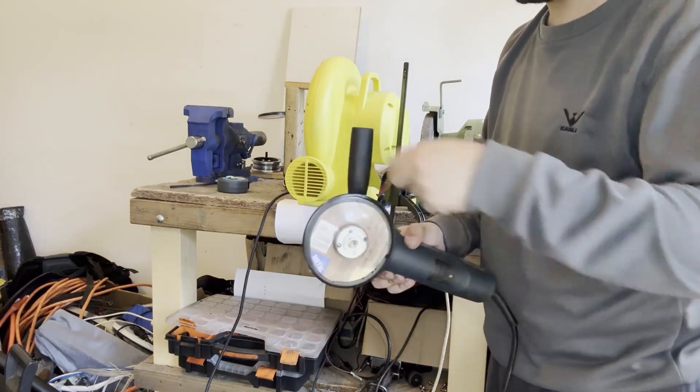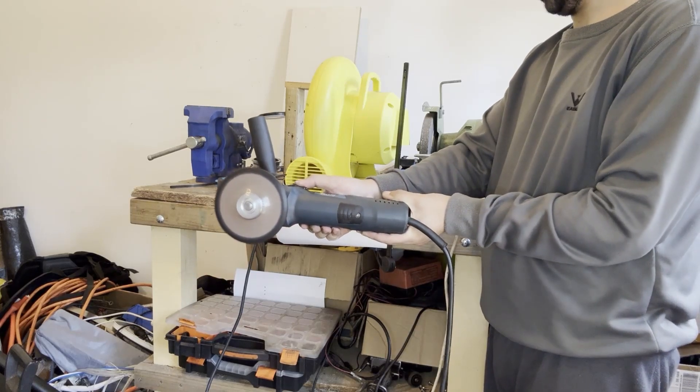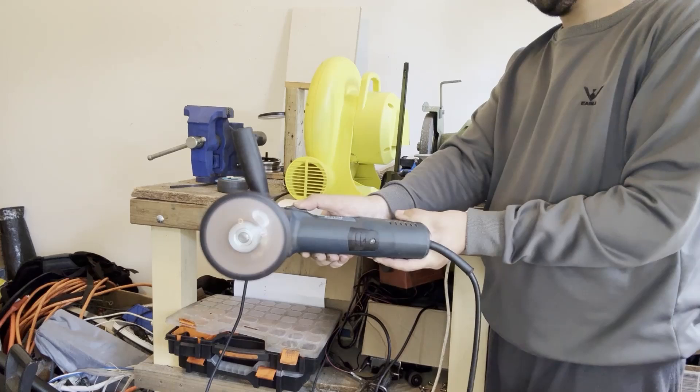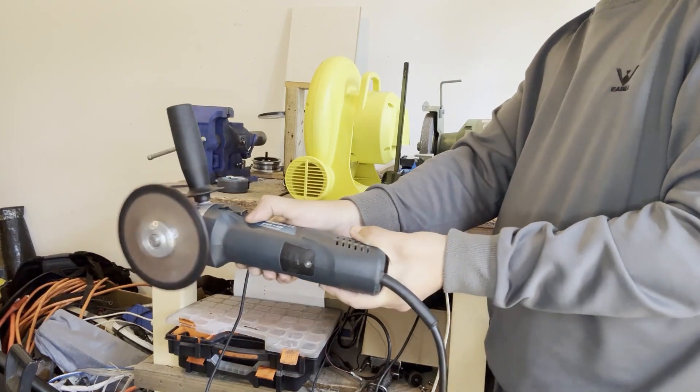It was annoying that the wire was getting caught on the back of the grinder, which I couldn't really do much about. I fixed the front spooling issue, but the back has a shaft going through it. I tried many things — touching the grinder head with cardboard or other material to push the string around — but nothing really worked. Then I got another breakthrough: air. By using an industrial blower behind me, I could force the string forward. As it was rotating, it would be pushed forward, and it couldn't wind up on the front because of my contraption.